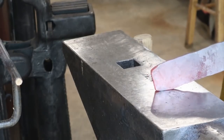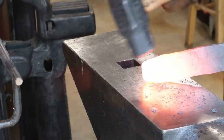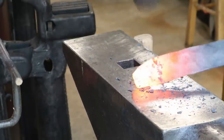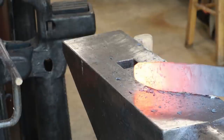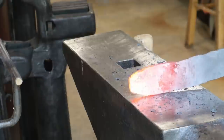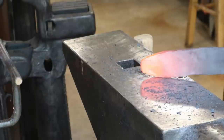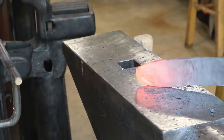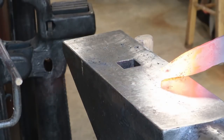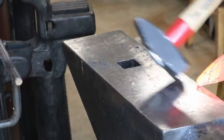We're going to forge in the tip, stretch it out, and try to equally hammer on both sides. We're going to forge it to a point — we want to get as much out of this steel as we possibly can. You want to make sure that you don't create a cold shut in the end. Basically you could get what's called a fish mouth if you don't hammer the end of the sword properly — you'll end up with two points at the very tip that won't forge together. So you want to manipulate the material slowly and draw it out to the point of the sword.